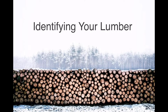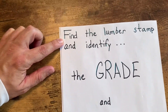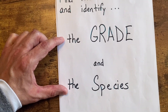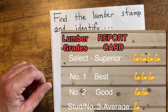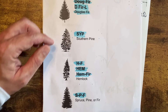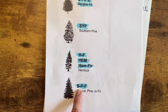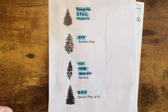Part two: identifying your lumber. In order to apply lumber science to your wooden weight rack, you'll first want to find the lumber stamp on your actual lumber. Once you find your lumber stamp, locate the grade and the species. The grade comes in the form of stud, number three, number two, number one, or select structural, and there are many different species of wood. When looking for your species, you'll look for abbreviations — for example, for spruce, pine, or fir, you'd look for the abbreviation SPF in the lumber stamp.